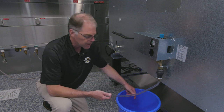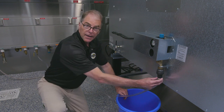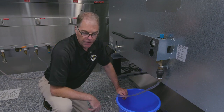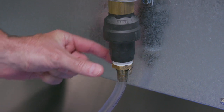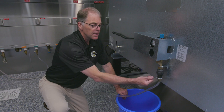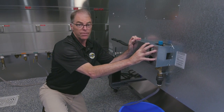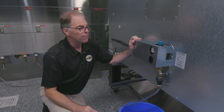So let it roll, and as long as everything looks like it's free and clear, you can turn off the valve and then connect it to the oven. This black piece here is a water stopper that would prevent any water from coming in and flooding the restaurant. This is a three-quarter US threading. You would connect it with plumber's tape, have a nice secure footing in the oven, and this is basically your whole steam system — your solenoid and your pressure gauge.